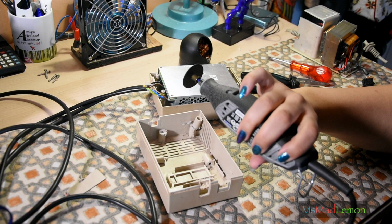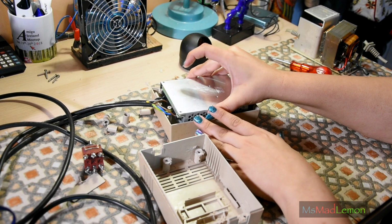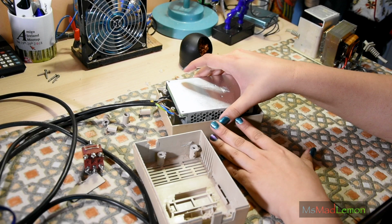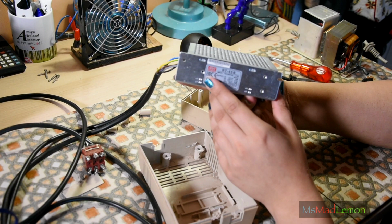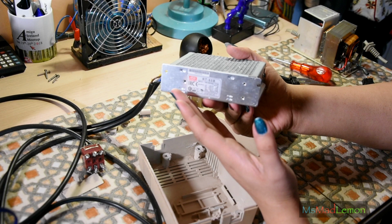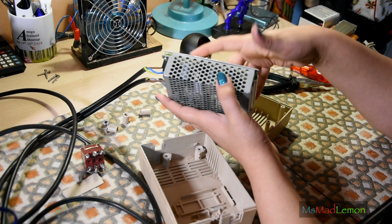Using this. I'm wondering now if I'll be able to actually fit this darn switch in here because it's huge. There is another model of this Meanwell PSU that will fit much more easily in this. I saw it on Mikey G Retro's channel, do check that out. He's used the RT-50B, and this is the RT-65B. It's 65 watts, as it indicates, and the RT-50B is 50 watts. There's only 15 watts of difference. So if you want a smaller one, that's another option you can do if you don't want to mod your case, that is. I don't mind modding the case, to be honest. I will also link that in the description below, as well as Mikey's channel.